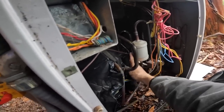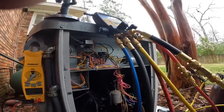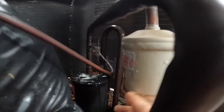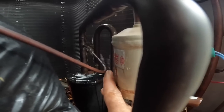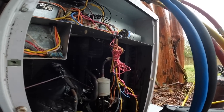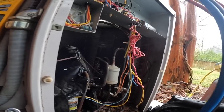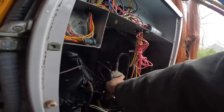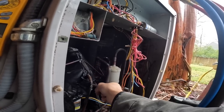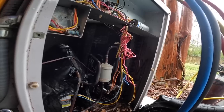It's right there — right there where I found it rubbing. Let's see if I can get y'all in a little closer. Right here. Well, it looks like we ain't charging it up today. That right there is not a dryer — you see, that's on the hot gas discharge and goes into the top of the reversing valve. That's a muffler. It looks a whole lot like a dryer but it's not.